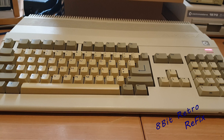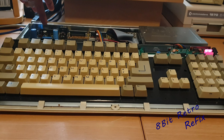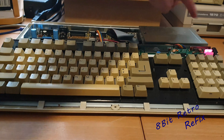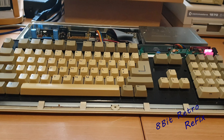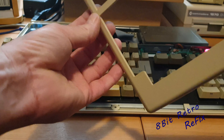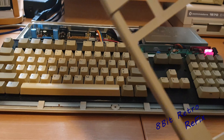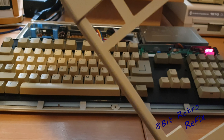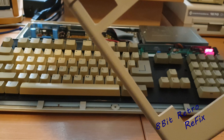So I'm going to pop the lid off and take a look inside. It's very easy — I've already dismantled it. There's a screw here, one up here, one down here, and three at the back. Just be careful with the clips at the sides — one at each far side — make sure they unclip properly or you'll end up breaking the case, which has happened on this occasion. A little bit of epoxy resin in there and you wouldn't even notice it, so we can repair that later.